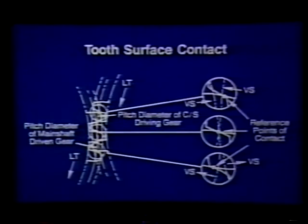Let's see how Fuller gears are designed and manufactured to minimize problems. The engine's power is transmitted between gear teeth in a sliding motion, then a rolling motion, then sliding again as the gears rotate. A thin film of lubricant is carried through mesh to prevent metal-to-metal contact. Because most loading occurs at full mesh, gear tooth profiles are designed to minimize wear caused by sliding motion.